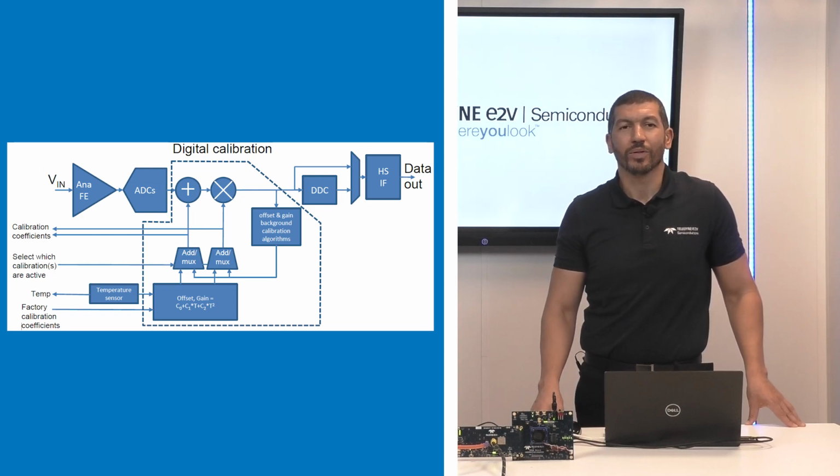Note that if it is a single-tone sine wave, its frequency must not be a multiple of fs over 64. Otherwise, the signal at the conversion core level is interpreted as offset and the local calculations are misleading.